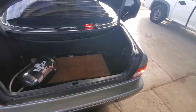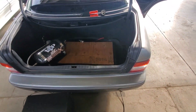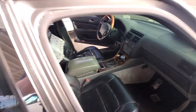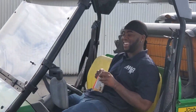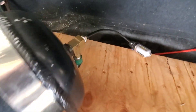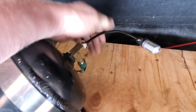This compressor is not turning off anymore. I just had everything wired up — I think it's leaking from the fitting at the end, that's why the pressure switch isn't working. Good thing I got that switch wired up for situations like that. I'm going to figure out what's causing the leak — it's probably because I grabbed that fitting with a vice grip not too long ago. I think I took care of it.